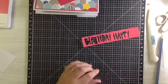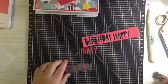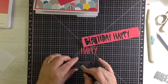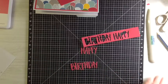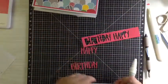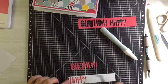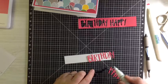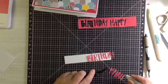These are three inch squares. This one here is two and fifteen sixteenths of an inch wide, and we're going to make some marks on this one. We'll lay it in at this point and make a mark at two inches, then turn it and make another little mark at two inches. I'll put a pencil mark so you can see — there and there. Then we're going to lay it into the trimmer, lay the two marks into the channel, change over to our cutting blade, and cut that section off.